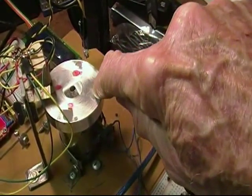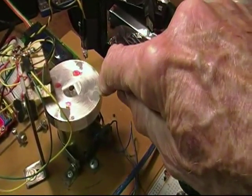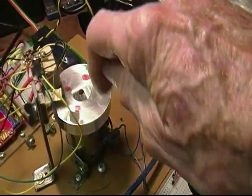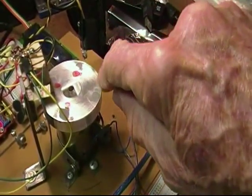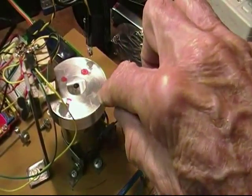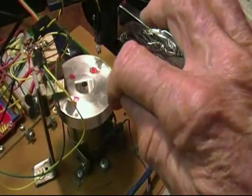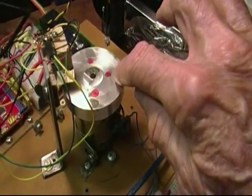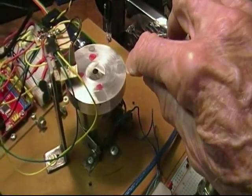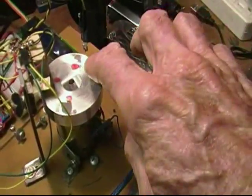The magnets are sunk flush and the pockets were so precise that there wasn't much room for epoxy to hold them in place. I just had to dab a little around the corners. I kind of covered each magnet — the edges are rounded a little bit with epoxy so hopefully there's enough to hold them in. They are also in a pocket with a sixteenth-inch rim holding them in, so they're probably not going anywhere.